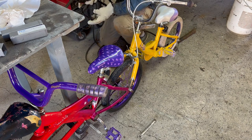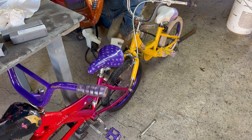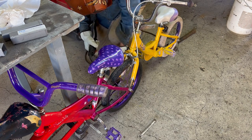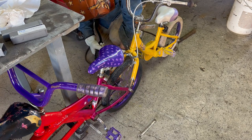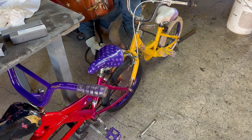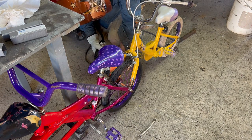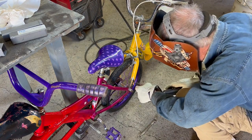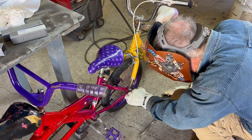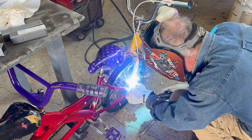So I'm making a little bit of a change. I've closed the bottoms of these little U brackets. I made them circular and welded a washer so it can't jump off the bolt. And I'm not bolting mine to the rear axle. I drilled a separate hole. I'm putting a separate pair of bolts with locking nuts so I can get them snug, but not really, really tight. Between those bolts being separate from the axle, able to move where the axle can be tight, and having the bottom of this horseshoe closed in, there's no way the forks are going to fall off, and that's what I wanted.